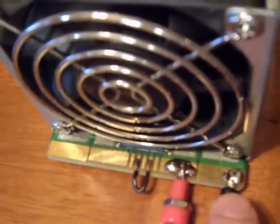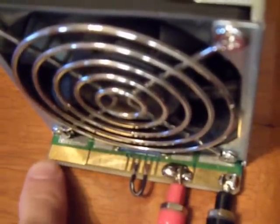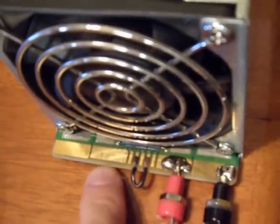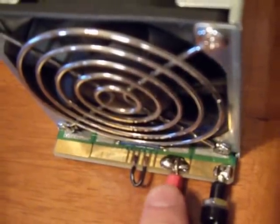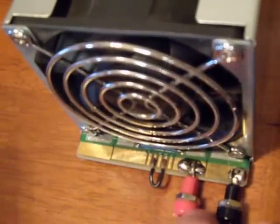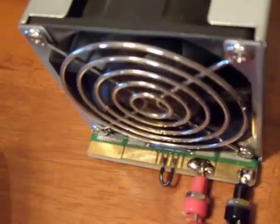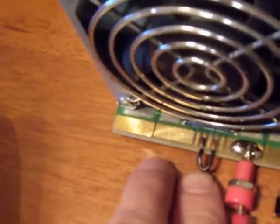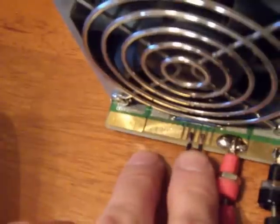Both this pin and the four outside ones are negative. This one and this inner one are both positive. You could put two jacks on this side if you wanted to, or you could put more on this side. I just left them spaced out, but you will have to short this middle lead right here.